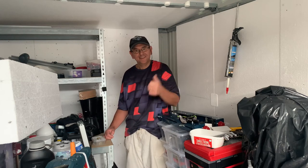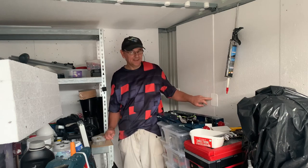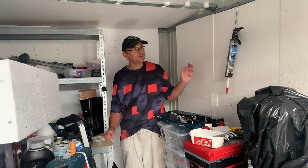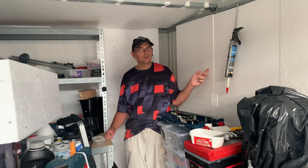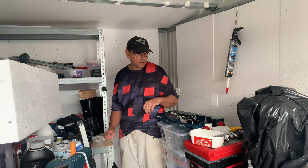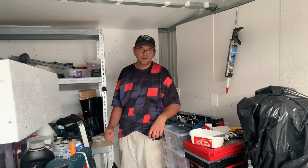And then take into account the issue I had with the PLA. Actually, I do have an issue with these, but they're obviously getting too hot because one of them twisted. When I measured the surface temperature on this wall against the metal, it was 60. The highest measurement I got was 64, 65 Celsius. So that's enough to start deforming.